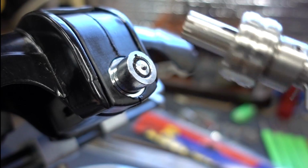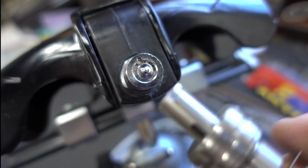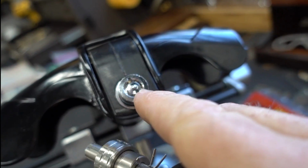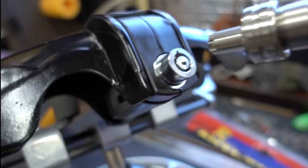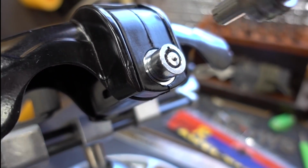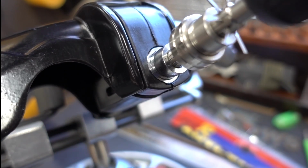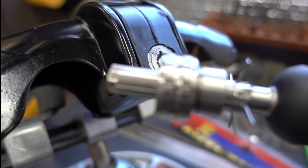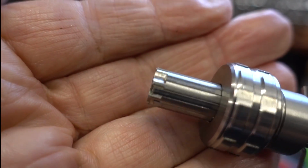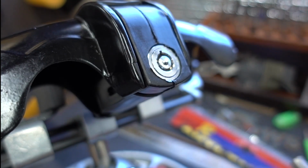But all you've got to do really is look inside of the lock. I think if you look down inside of it, you can see that the 12 o'clock is located. There's a missing pin right there. So I would just rotate this, put my 12 o'clock, kind of look around the camera here. Should be able to get it right back there. And that should be enough to relock it. And it is. Tighten this up, and you've got the bitting for this lock, just like you do the interior tensioned 7-pin tubular lock.